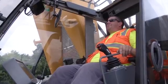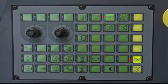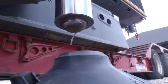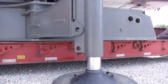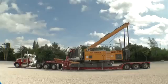In order to activate the cylinders, you first have to operate the safety lever and pre-select the cylinder function on the X23 control panel. Then control is shifted to the jack-up control levers on the undercarriage. Bring the cylinder into the lower pinning position in order to allow for maximum supporting height, and then extend the cylinder until contact is made with the ground.